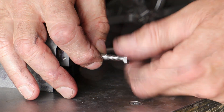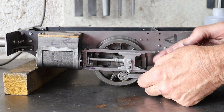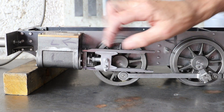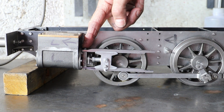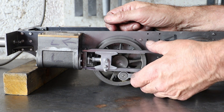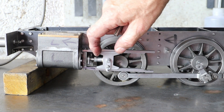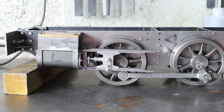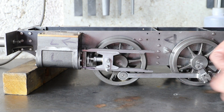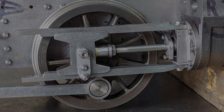I also made a couple of locking nuts using some 3/8 hex bar. It does all appear to be coming together nicely — no evidence on either side that the crossheads are going to bind in the slide bars, or that there is any binding with the piston, the rod, the covers, the gland, or the crosshead. I'm feeling quite comfortable at this stage. I did say in the last video that I would talk about errors in this video — I'm not actually going to do that, but there is a major issue about to bear down on me which we'll cover in the next video when I get into making the motion brackets. On that ominous note, thanks for watching.